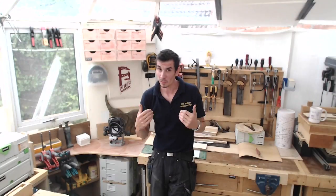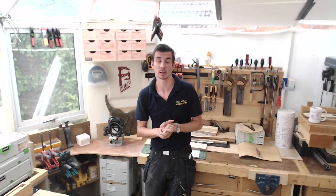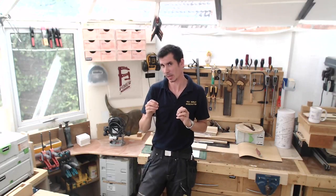If it's not printed on the cutter, then look it up online or ring the company. I noticed yours were made by Grizzly — ring Grizzly and ask them what speed they recommend for that cutter. If they don't know or can't answer the question, again I wouldn't be buying my cutters from them. So put the onus a little bit more back on the supplier. If they can answer it, great — make a note of that. For me personally, the supplier I use tabulates and provides the RPM information very clearly, either printed on the shank or as part of every bit of packaging for every cutter they sell.